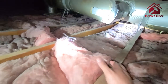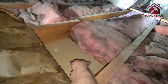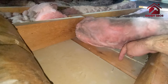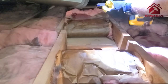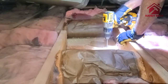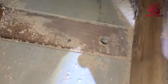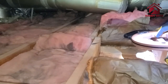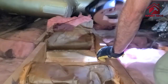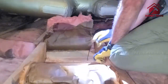I'm in the attic now, and this is where the nail by the wall plate is — right here, that's the nail we poked in, and this is the wall plate right here. We're going to drill the hole right here — it's about one inch, 15/16 of an inch. It's time to use the fishing tape. I'm going to feed it down hopefully all the way into the knockout. It's really helpful if you have someone by that electrical box to guide you, so I'm going to call my wife now.